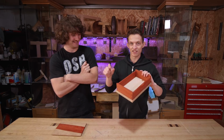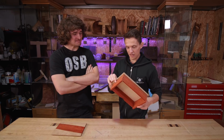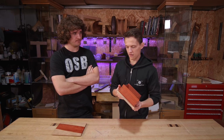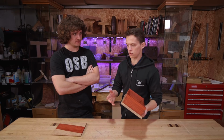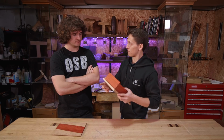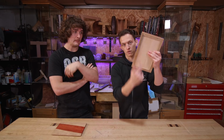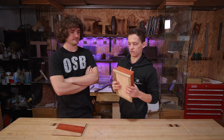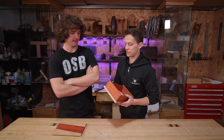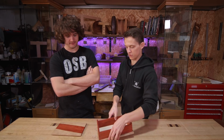Oh yeah, I forgot you did that. Yeah. That was pure panic. I can't believe it didn't break. And then when you clamp the short sides onto the long sides, well, I had a little bit of time between the two of them, but ideally, I guess it's still sort of wet on the long sides as it's gluing. But you could clamp stronger on the corners. Yes. Yeah, so basically what I'm getting at is I did a clamp that way, but I didn't do that until the last minute, and I really should have done. Yeah, so put more pressure on the miters in order to close up those gaps. Exactly. Yeah. It's because I thought, well, it's glued, so why should I put clamps there? It's obviously worth still putting some there anyway.